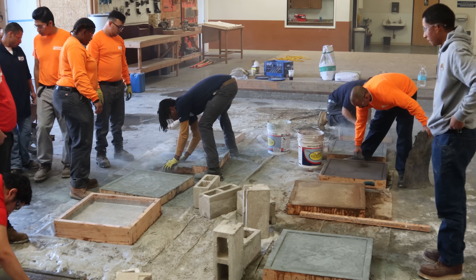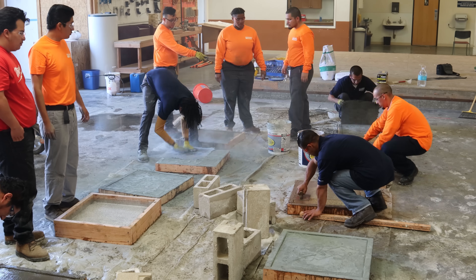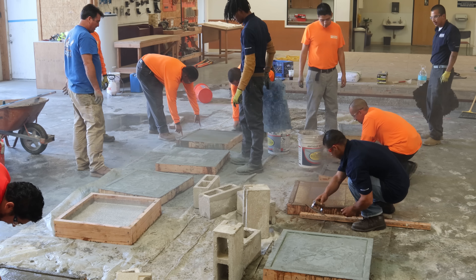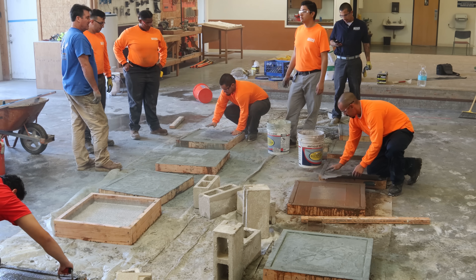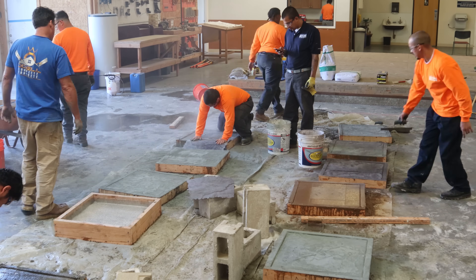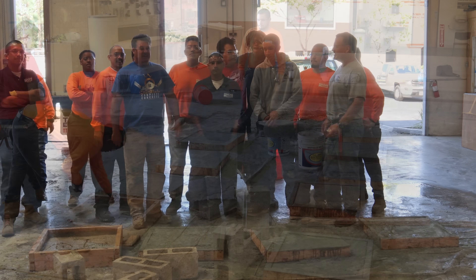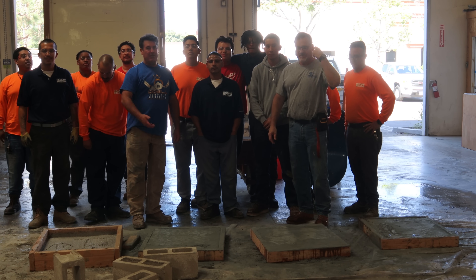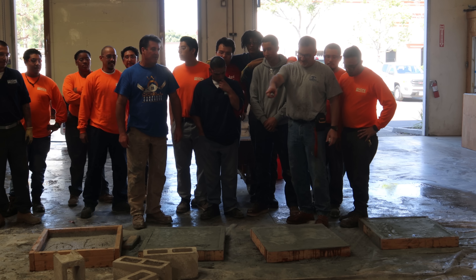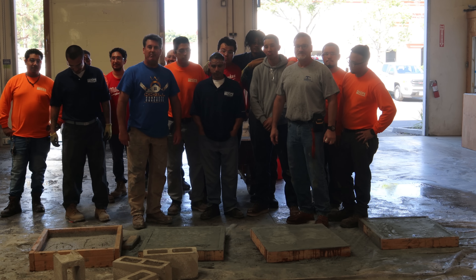There are pounders you can use to drive the mats in, but these areas are small so we're just patting them in by hand. To keep the mats from drifting while pounding, one hand stabilizes the mat while the other hand pounds, so the mat isn't bouncing around. We also did a little top cast — this recessed one here has top cast on it. That wraps it up: we poured the concrete, set a few blocks, did some stamping, some integral color — a little bit of everything. They'll rinse this tomorrow or the next day.